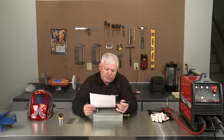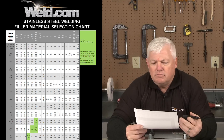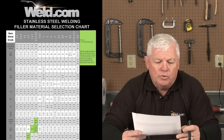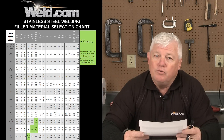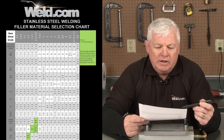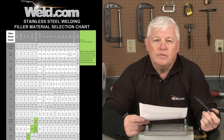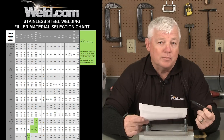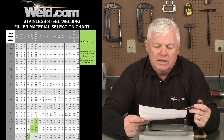I just want to define a couple of these stainless steels. There's a whole list of them — we've got 304 stainless, 310, 316, 321 stainless. How do you select the material for your application? We're going to start with the most common, which is typically 304 stainless. When you get ready to weld 304, this chart will also tell you what filler to use. Getting ready to weld 304 to 304, the chart tells me to use 308L filler material. And just so you know, you can weld mild steel to stainless steel — just look at the chart and it'll tell you what filler to use.